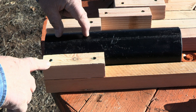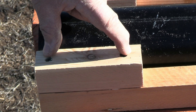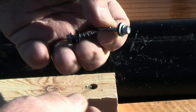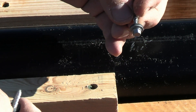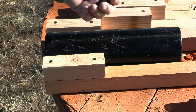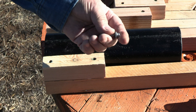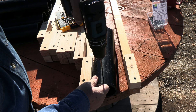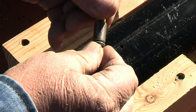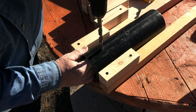I'm going to be drilling two mounting holes inside this piece of ABS plastic — I just want them inset so I don't hit the edges. The screws I'm using are stainless steel metal roof screws with a washer; they are designed to use outside in the elements. You don't want to use a drywall screw — that's for indoor use and they'll rust out in just a couple of years outside. We'll start with a couple of pilot holes and then move on to a bigger drill bit. I have to get this screw and the quarter-inch driver through that hole, so I've got a bigger bit on — we'll get that taken care of.